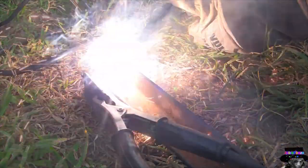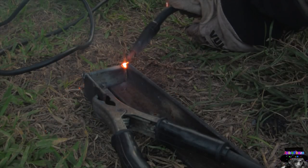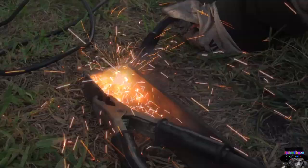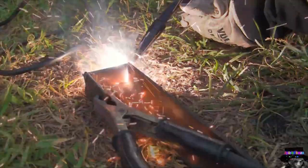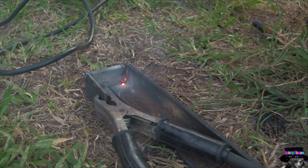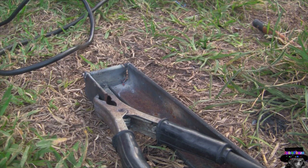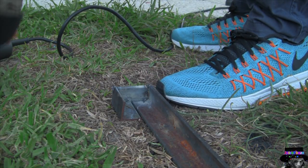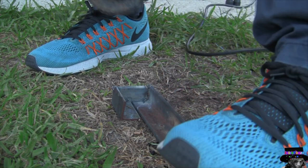Right here it fits normally, and then I'm going to cut that last piece off. I'm not welding it all the way — not the whole side of the angle. I'm spot welding it: a little corner on the top and a little corner on the bottom.